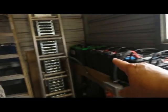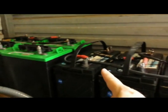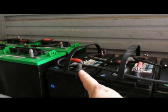I have 12-volt batteries all in series providing 48 volts — four in series over here, four in series over there, and then the rest are in parallel. So going from the first to the second: 12, 24, 36, 48 volts. You can see there's a cable going from this one to this one here — that's my parallel connection to the other bank.